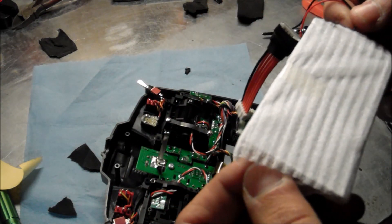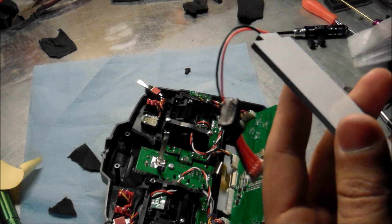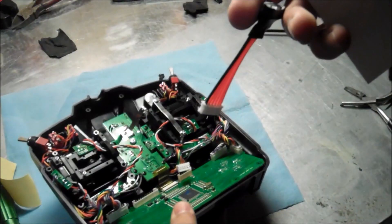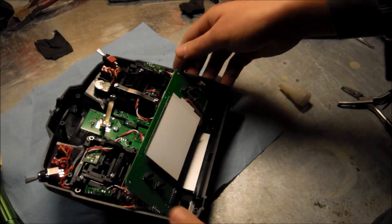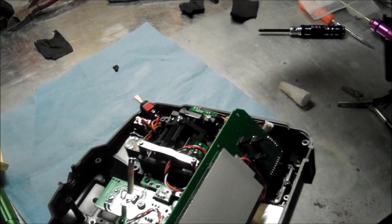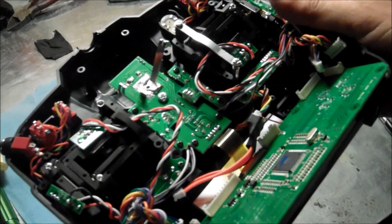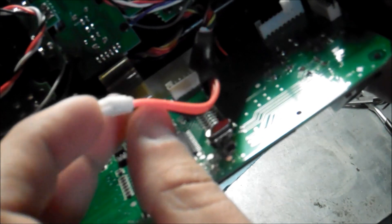Next thing you want to do is get your LED. Be careful with that — just be careful with the whole remote. You kind of want to have patience for this, you don't want to rip any wires. To install the backlight, there's this wire right here — you're going to want to disconnect this, and then on your kit you're going to connect it here, and then where the old one was you connect this there. The backlight is going to go on top of the foam. You can use super glue to put on the foam, then put the backlight on top of the foam and that will hold it in place. Another thing I did was I just disconnected all the wires that go to the board — makes it a lot easier. You can see where the backlight is connected right here, and then this is going to get connected here.